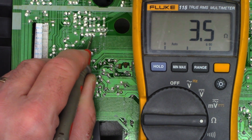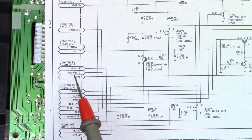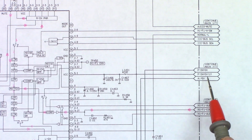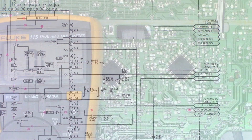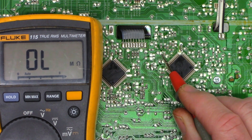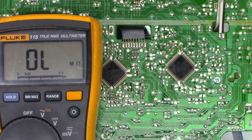Let's follow this out and see if there's a little capacitor that goes to ground somewhere — I'm betting that's going to be the problem. After following the schematic a little bit farther, I came back to Main 4 of 7, power on 5 volt number two. So there is power on 5 volt number two. It comes in, goes through what they indicate as a coil but it says just a wire, a 0.022 to ground, and a 220 microfarad 6.3. I'm going to bet that's the culprit right there — C1466. I just need to find it now. So I have found C1466 right here. One side of it is 3.3 ohms, the other side is 3.4 ohms. I'm going to unsolder one lead and see if my resistance comes back to normal.